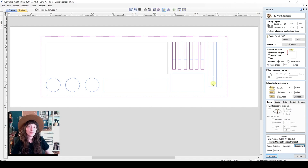One thing to note is that if your grain direction is left to right, the tabs that are going parallel with the grain, so if they're on this side and the grain is going this direction, that means the tab will be really strong because it will be going with the grain and it's really taking advantage of that long grain. If we place them perpendicular, they won't be as strong, but they will be a lot easier to clean up because when you cut the tab, it will cut on the grain and separate. So if you choose to put them with the grain, be very careful as you remove them as they can really tear out later on. So there's really pros and cons on either selection.